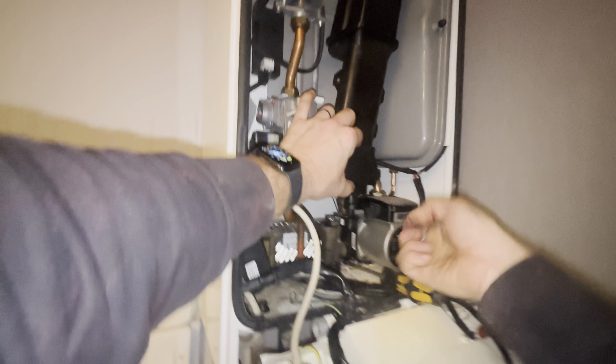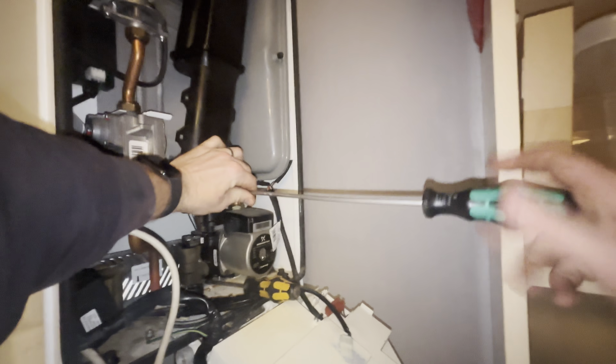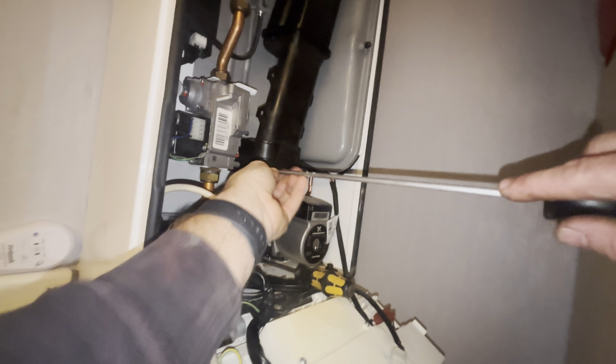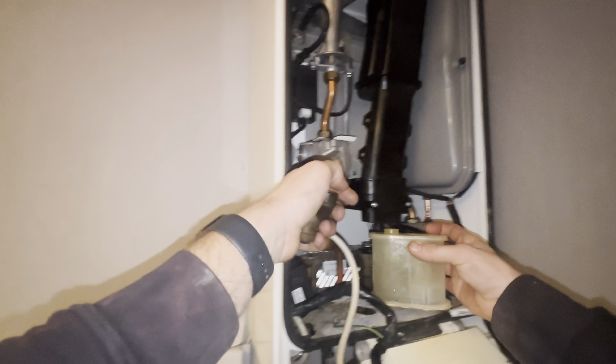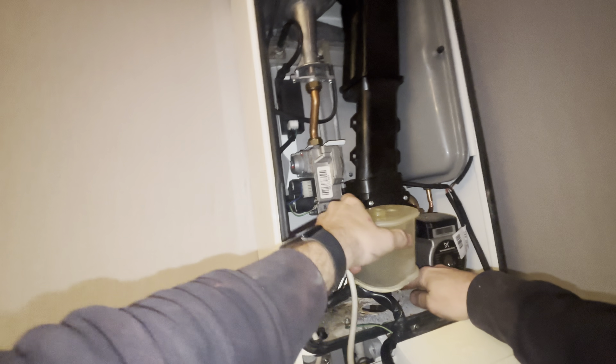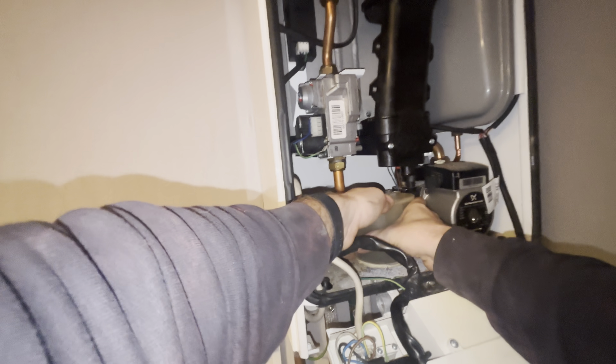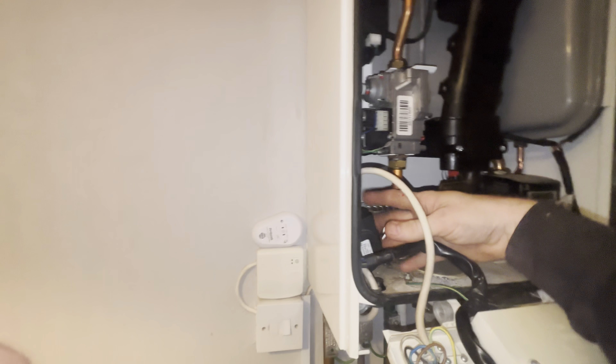New sump cover - let's get you in. Tighten that screw up, tighten that screw up. Nearly there now. Last job - condensate. Good opportunity to give that a clean out. That bit there goes over there - it should push down like that and twist like this. Hose on around. Don't forget to reconnect your pump. Other than that, you're ready to turn it on.